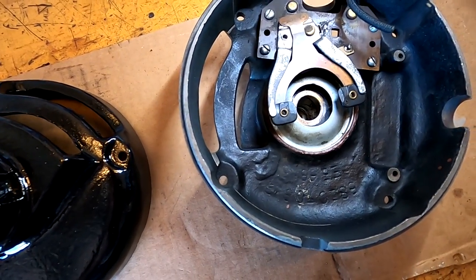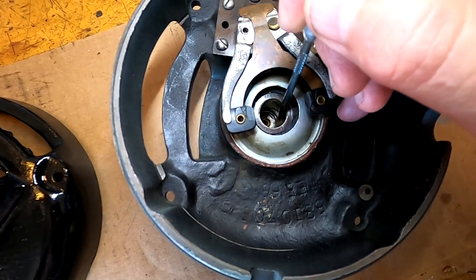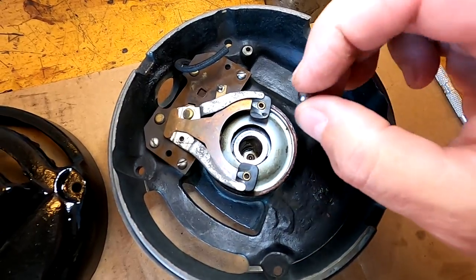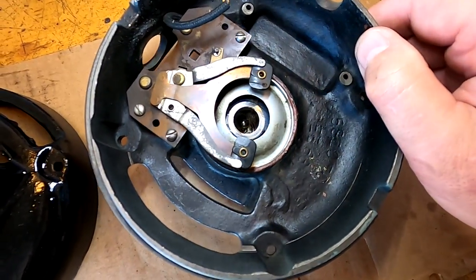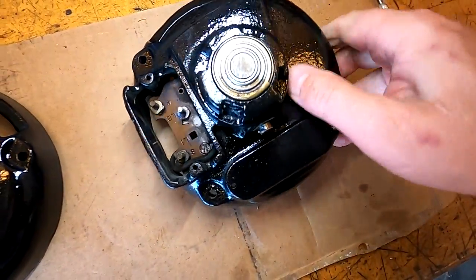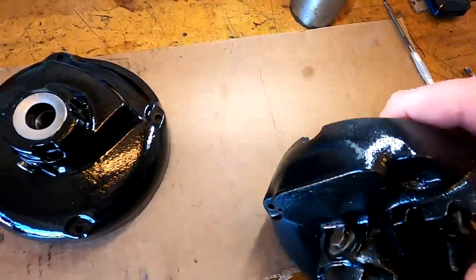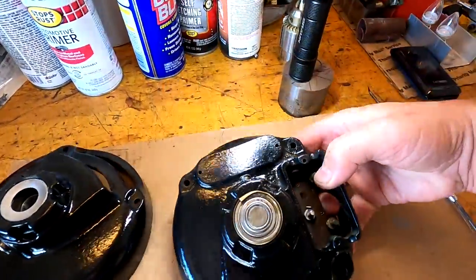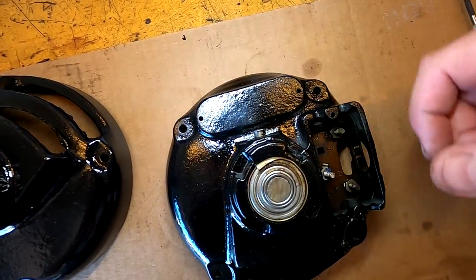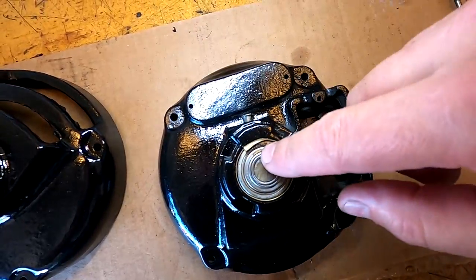The other thing is, looking inside here, the packing material is coming out, and this is on both of them. We're going to take care of that. But what we're going to do first is this. This makes me believe this motor was modified to run on end, because this ball bearing was placed right down in the end for the shaft to run on. I don't believe that was originally there, because the Gits lube things here stick straight up this way. They weren't meant to be faced up and down like this. So that's another thing we're going to change. We're going to try to devise a way for these Gits lubers to come out and face up, so that when we lube this, the oil will stay within the tube and supply the end.